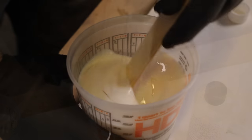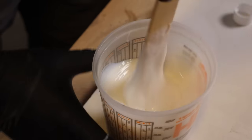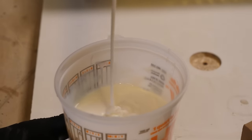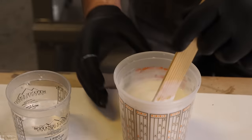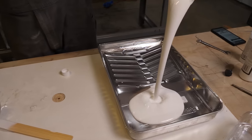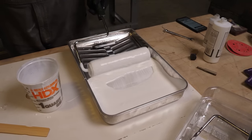And we're mixing. This material is quite thick right out of the jar. You never wanna apply the ultimate top coat right to the countertop right out of the jar. You wanna thin it down. It's very thick out of the jar. See how it's like Elmer's glue nearly, guys. And then I'll add a little bit of my water at a time and then mix. See the difference? See how the material self-levels in itself instantly? We're going into the paint tray. All right, let's come in here and saturate your roller fully.